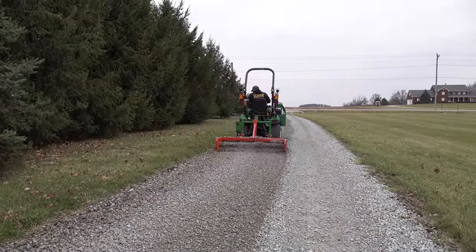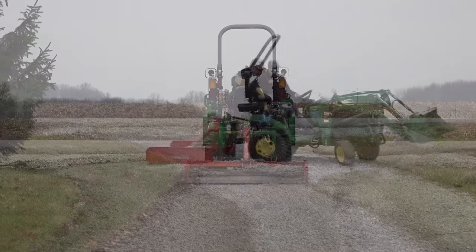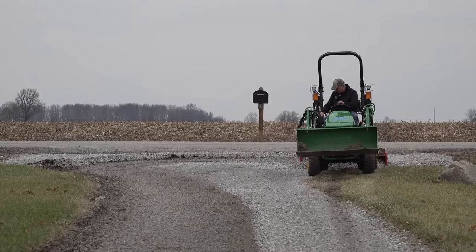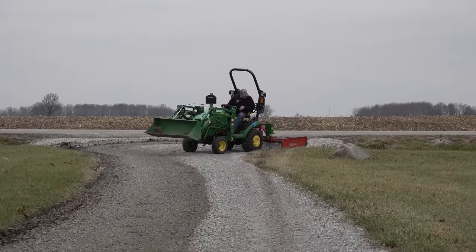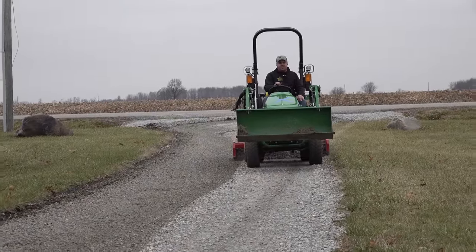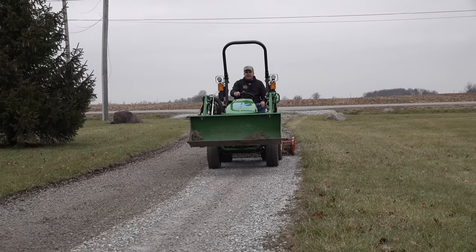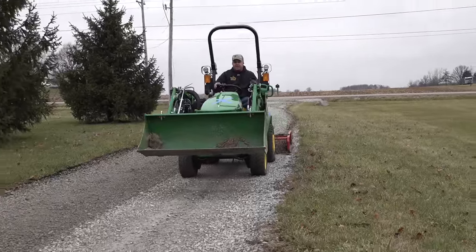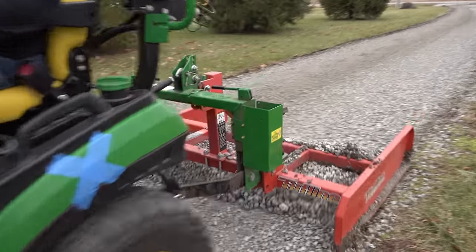In addition to just moving around the rocks on top, I like to dig in just a little bit to that solid surface. I want to mix that in just a little bit — just enough to get any holes that are developing filled up. If you're running a land plane optimally, you can never pick it up; just leave it down all the time. I'm running in low range with the pedal all the way down. I just noticed that I don't ever feel any engine lugging at all — it's staying at full RPM.